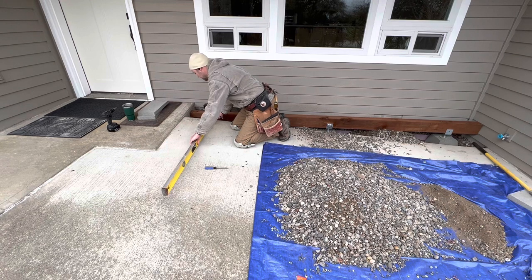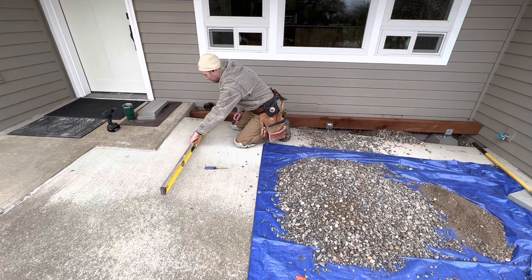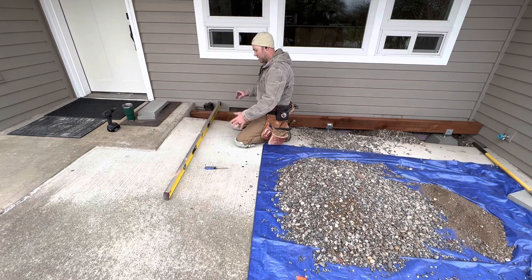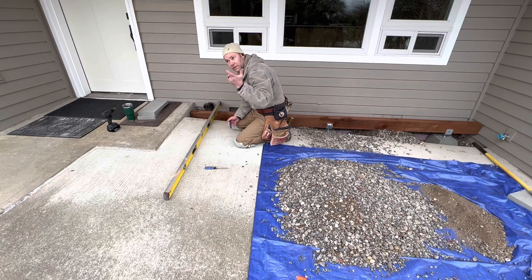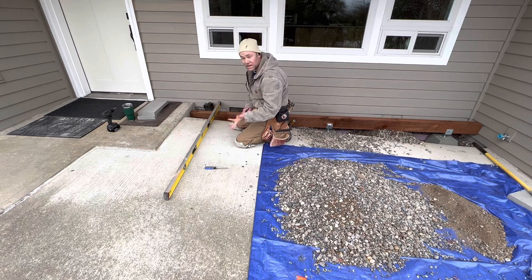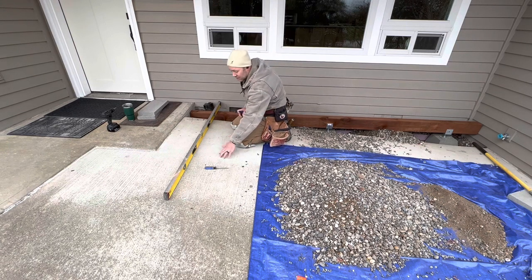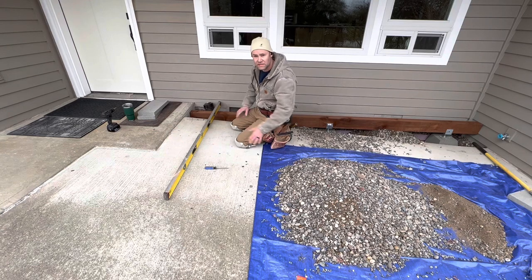This end drops down, which is fine, because I'm going to have to rip the whole thing down anyway. Remember, these joists are sitting on concrete, so they don't have to be more than an inch thick — as long as I can attach decking to it using a hidden fastener clip, which I have. It doesn't matter much; it's bearing right on the concrete. The whole point is just to hold the decking up a little so water can drain away — that's the sleeper system.